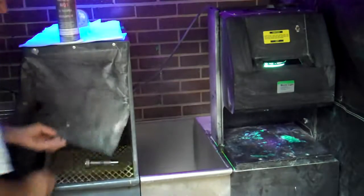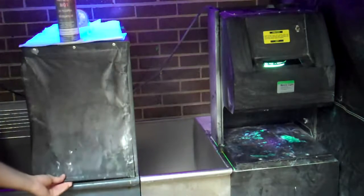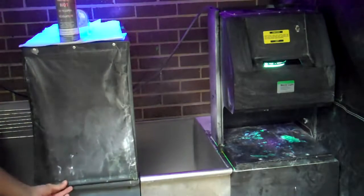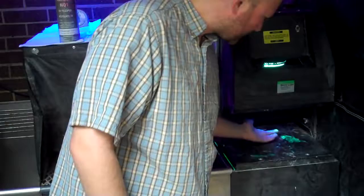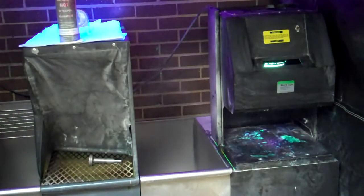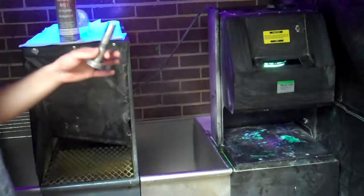This thing's drying here. I'm going to kind of move us over to the right a little bit so we can see what's going on. My dryer's already been heated up — it's less than 160 degrees; our dryer here is only about 140, which is perfectly fine. And if you look over here, you can see in the black light I've got a little penetrant messing around with me here, so I'm going to have to read through that, knowing that I've already got fluorescence there that's going to provide some kind of indication I may not be too happy with.